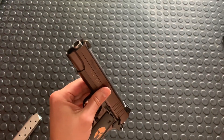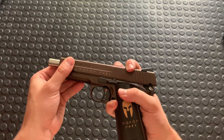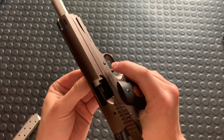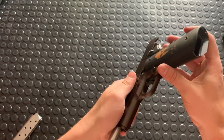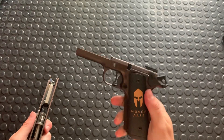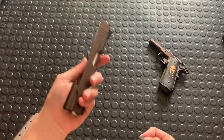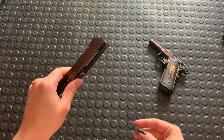I'm assuming this is pretty much mil-spec for 1911s — there could be some out there that have slight differences. Safety off, pull this thing back to the disassembly notch, which is this middle notch here. This is the bolt catch, or the slide catch — not that far, just this other little notch right in there. Then this guy will just pop out — it should be pretty loose, but it'll pop out. Take that out. Now the rest of the slide will just slide right off. There's your frame. This is typically the serialized and controlled part, by the way. In Canada, this is what counts as the firearm. It's interesting how laws change around the world, but that's a bit more of a topic for another video.